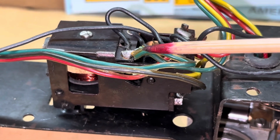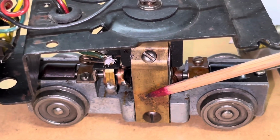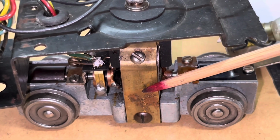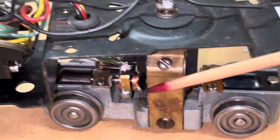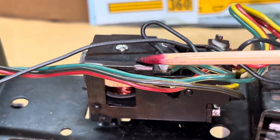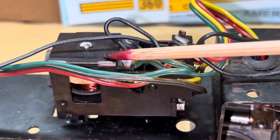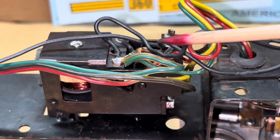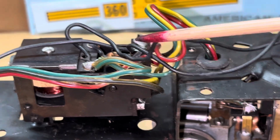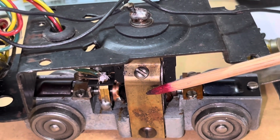In other words, one of the things he's saying is that if you ignore this and then go in and rebuild the motor and it still doesn't run, you still don't know if it's the motor or the reverse unit. The opposite of that is I like to get these perfected so that I know that it has electrical flow, its operation is correct, all the contact points are working, all the components are working, and then when I go to the motor, I have a higher probability of being successful.